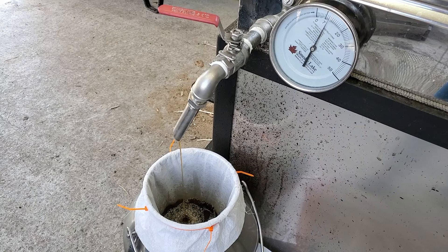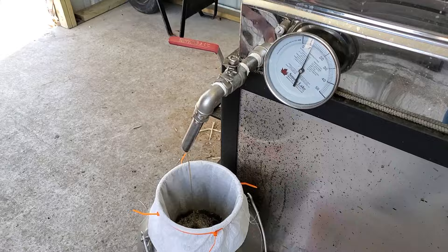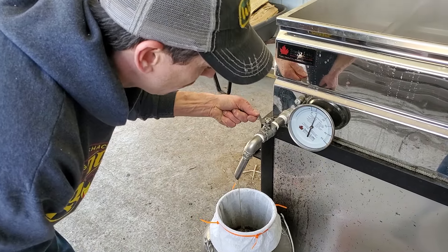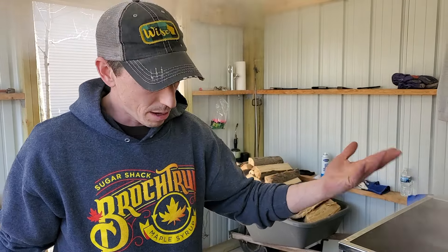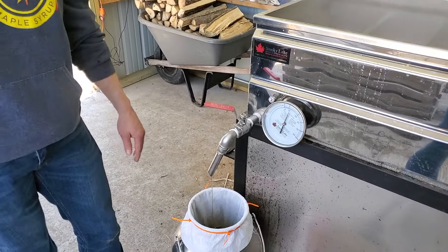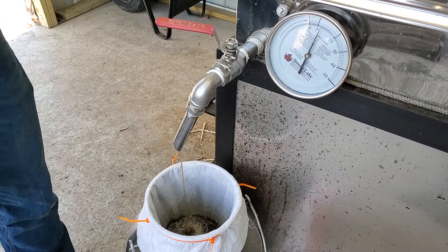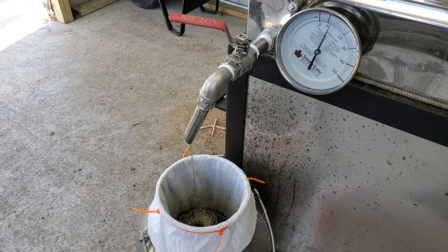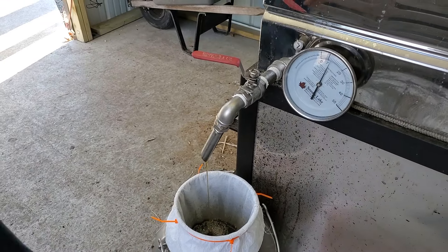You'll notice I'm over the seven mark, but that's what we had tested on this evaporator. It's leveling out at about nine and a quarter on the analog gauge. I can open it up just a little bit — the float box in the system will adjust and bring in the available sap needed to compensate. We just loaded wood, so we have plenty of stack temperature and plenty of fuel to carry us through this draw.